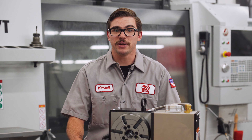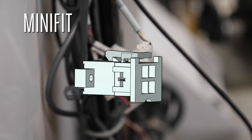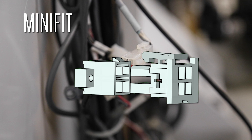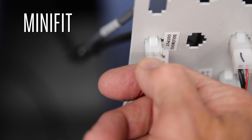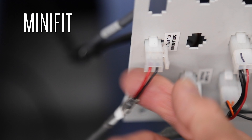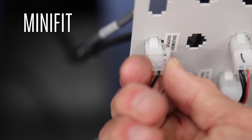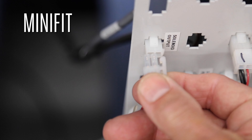The second type are mini fit connectors. Mini fit connectors are used on cables that carry both power and data. They come in a variety of sizes but are distinguished by the prominent latching device on one side. To connect, push it straight onto the receiver connector until the latch clicks into place. Always pull on the connector, not the wire. To remove it, push down on the latch and squeeze as you pull it straight out. Make sure you never twist it into place.